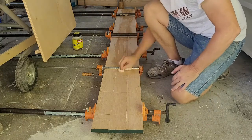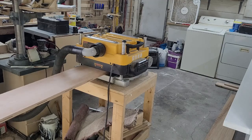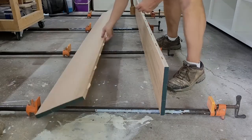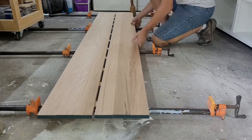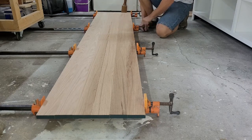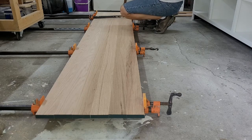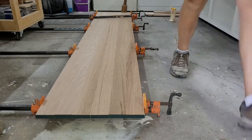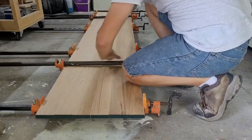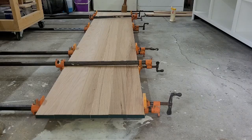Once this half of the top had time to dry, I repeated the process for the other half. A couple of passes through the thickness planer on each side and the faces are smooth and reduced to the correct thickness to match the rabbet in the bar rail. Because I had already cut the slots for the biscuits, I made sure to run them the same number of passes on each face to keep the slots aligned — a better plan would have been to cut those slots after planing. For the final glue-up, since the stock is at final thickness and oak is an open-grain wood, I don't wipe off the excess glue — it could get smeared into the pores and show up as blotches during finishing. Instead, I let it set for an hour and then scrape off the squeeze-out before it gets too hard.